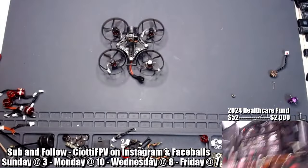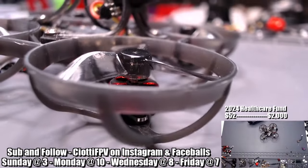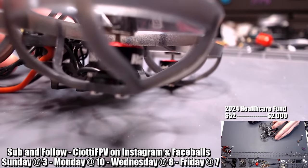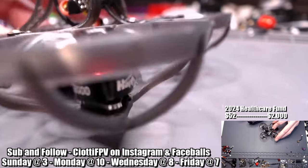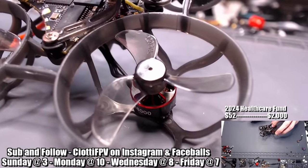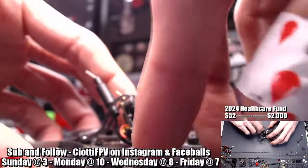One thing I definitely noticed here, let me give it to you on the close-up camera, is that they have not pushed the propellers all the way down on the motor shafts. This is a great way to bend your motor shafts right here. They've pushed the propellers down most of the way to the point where the shaft is almost poking through the top, but you wanna push these down all the way.